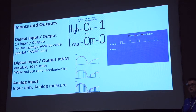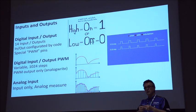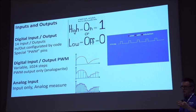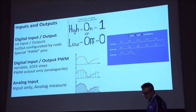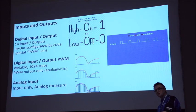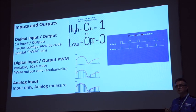Other than that, there's no real way of controlling it. You can reduce the voltage that goes into the servo. Where the servo is powered between ground and voltage, you can start to turn that down. That will make it a little bit slower, but it will also make it a little bit weaker. So it's really about understanding the options you've got software-wise to ease the servos, and then tuning the voltage down to get smoothness. On the other DO, I've got a voltage regulator and knocked it down to about 3.2 volts or so, so I get the head quite smooth. As you start to pay more money, things get a lot better. I've tried to keep everything quite low cost, but obviously once the models get released, people start to upgrade them with greater and better options.